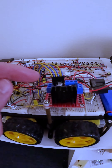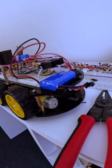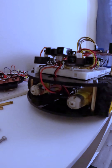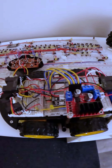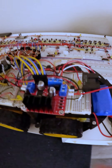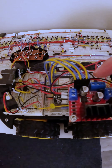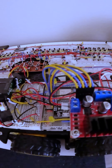The main thing that I just wired up is this L298N motor driver board. If we look underneath the robot, there's two motors on this side and two motors on this side. The left two motors come in and connect here, and the right two motors are wired together and connected here. These are ferrule crimps, which I used to make those connections. The power connections come in here, and there are six input commands that can be sent through these wires right here.